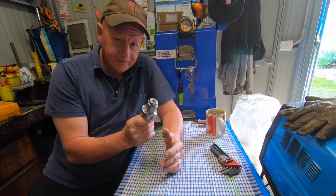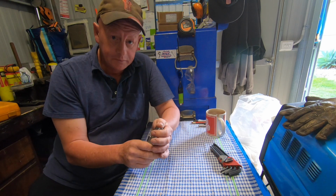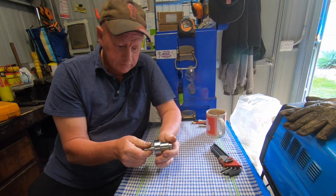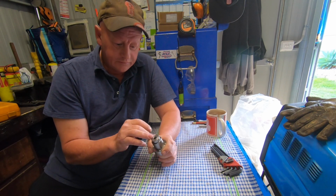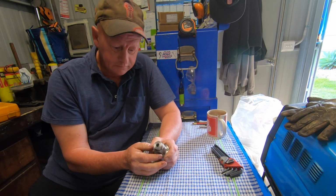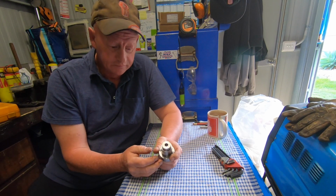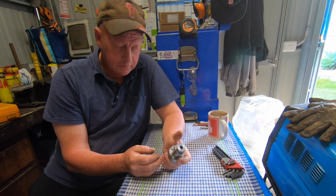I want to say big thanks to Tommy for the plans. They were good plans, easy to follow. I had no dramas with it. So if I can follow them, anyone can. I went 3/8 with my broaches, only because I had a couple of sticks of 3/8 high-speed steel, instead of going to buy some 10mm stuff. That's the only change I made to it.